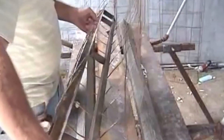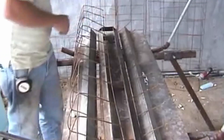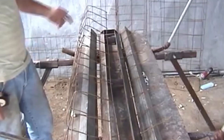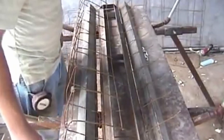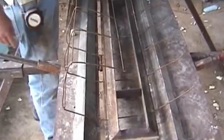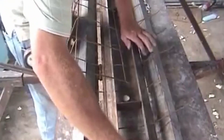Reposition this by picking up the whole thing together and giving it a twist to flop it over to the next position where it needs to do the next two folds. Get it over on top of that and get things positioned before you try to start clamping. You start with the long U and get just one shoulder of it underneath. This footer block is pretty worn out but it doesn't seem to be a problem — we've adjusted and learned how to use this tool. Probably the only modification I'd make would be to raise the center block so flat pieces of steel are easier to get under there.